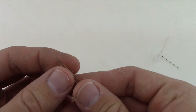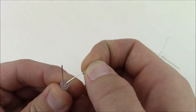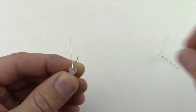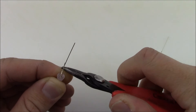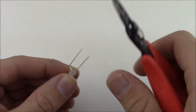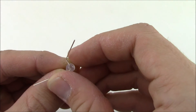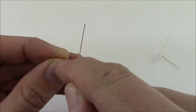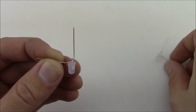The first thing we're going to do is bend the LEDs. Grip the LED in your hand and bend the long lead over and to the left. Then take pliers and bend the long lead up, leaving about an eighth to a quarter inch of a gap between the end of the LED and the start of the bend. Once the long lead is bent, bend the short lead down. That's the whole LED bent.